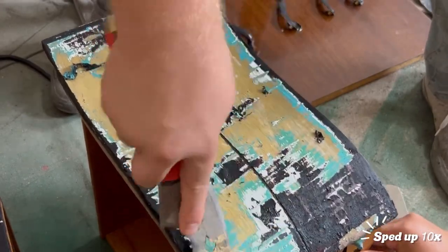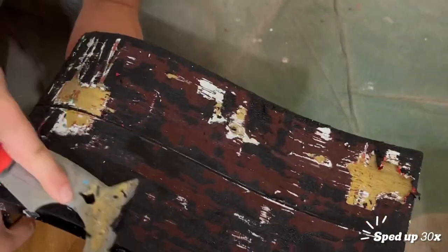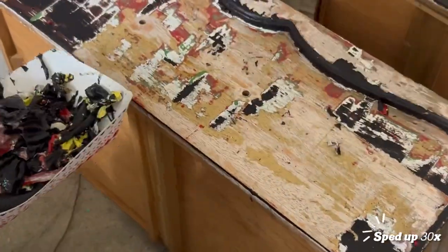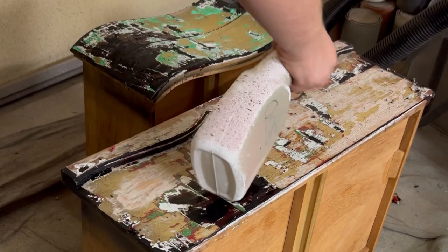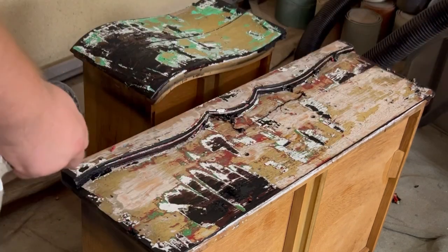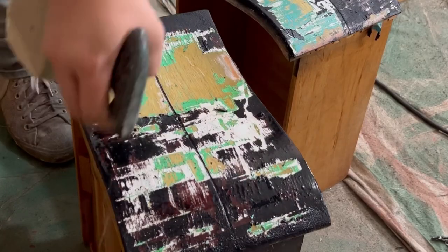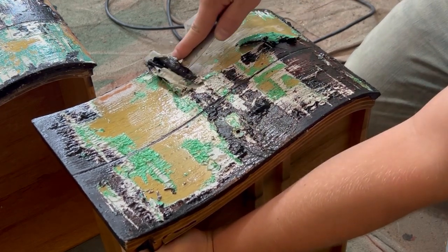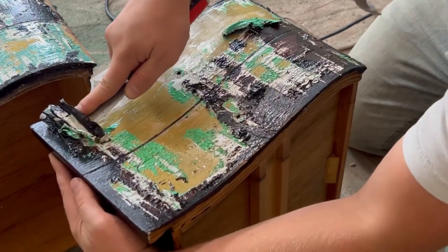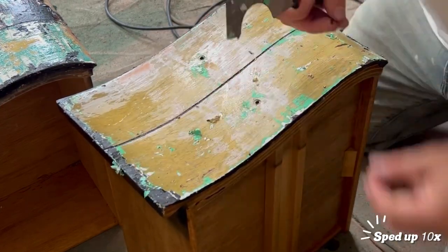Some parts were easy and some parts were hard, so we'll just have to reapply some more QCS on the parts that didn't come off so easily. On our second application we did the same thing again — sprayed the surface and then scraped afterwards. This time we had more success and could tell we were getting closer to bare wood. We've tried citrus strip, clean strip, and aircraft stripper, and none of those have worked as well as this. So we're already super impressed with how this is knocking out seven layers of paint.